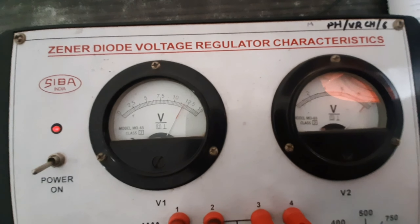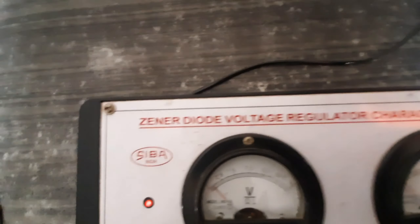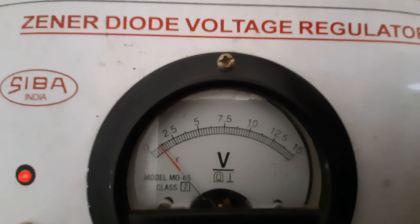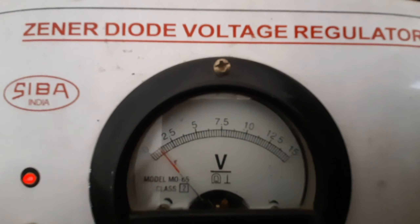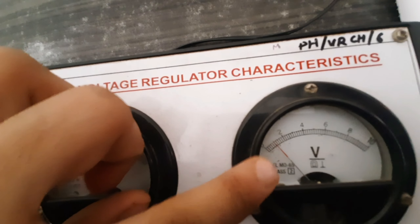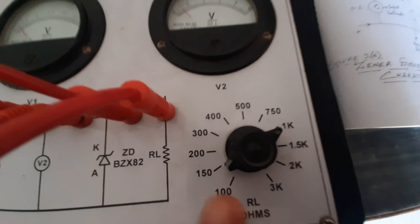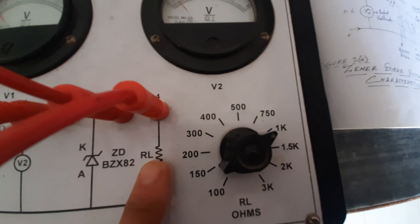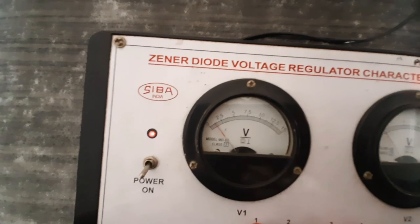At this point the output voltage is constant. For the first case — input voltage versus output voltage — make a table and increase the input voltage in three or four small intervals. Note the needle position; for example, at the 4th division, the reading is 4 × least count of this voltmeter. Note the corresponding output voltage. Keep the load resistance RL constant at 1K (1000 ohms).